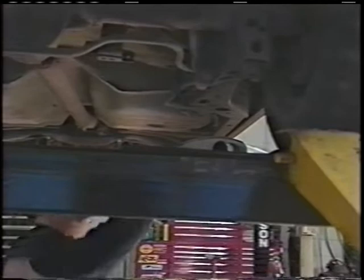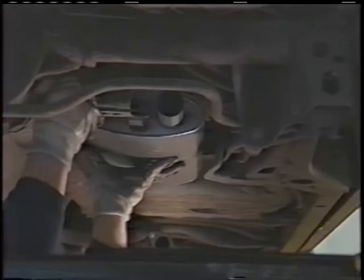Okay? Get our air wrench. Get that so we can hold it. Working alone here. We've got our muffler. We're going to install that to the hanger at this moment. Take our self-tapping screw. We'll get it started there. We'll take our air wrench and we'll go ahead and snug that bolt into there.